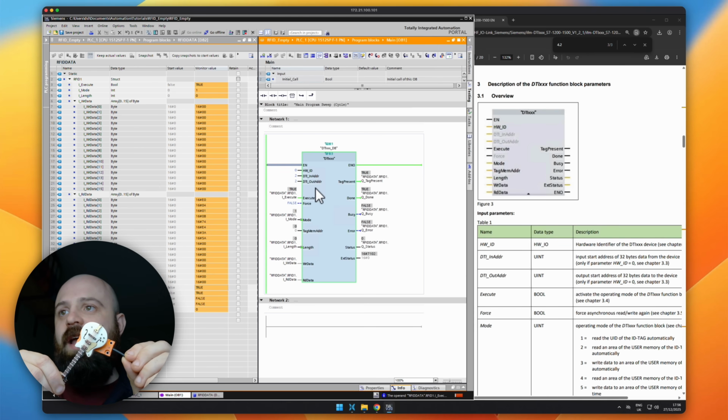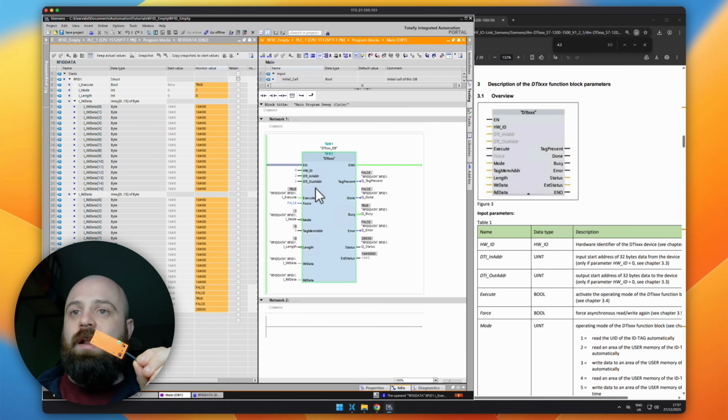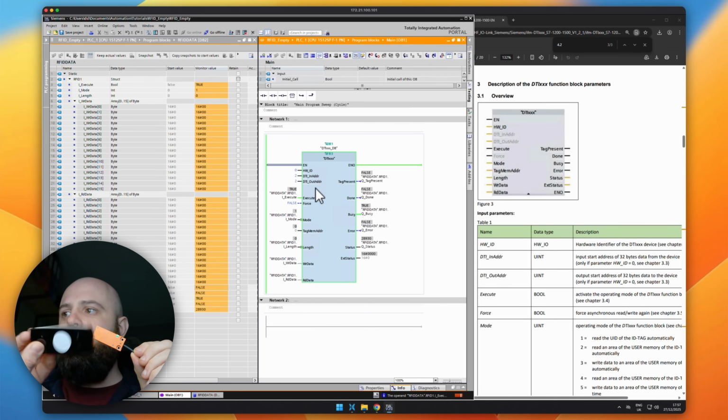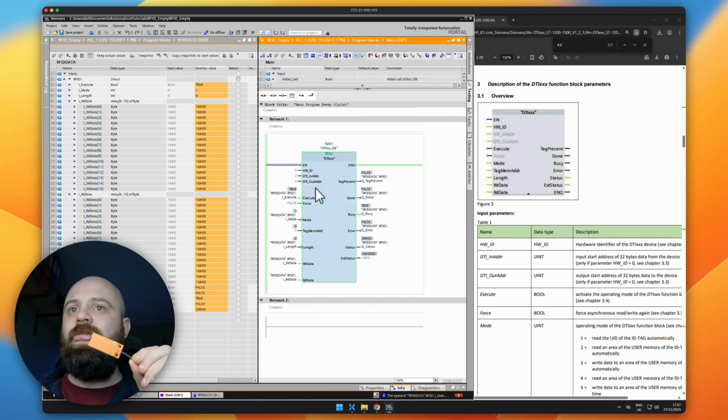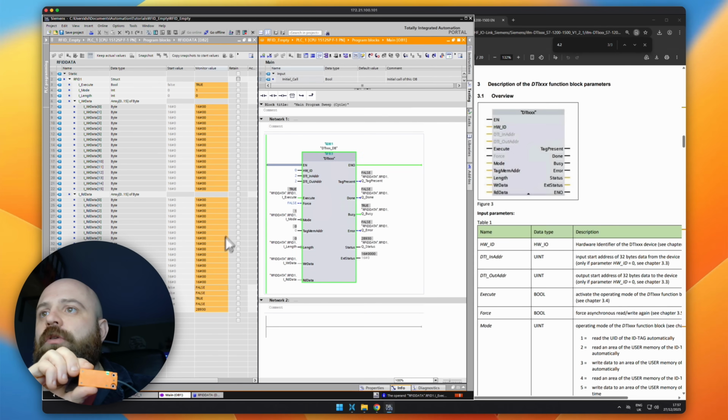So you see 3A, 5A on byte number 6 and byte number 7 there, and that shows that we have the guitar here. And if I pick up this small piano that also has an RFID tag on the back and put it in there, then we see, there we go, the two different RFID chips working. Perfect. Okay, so this is good. We're able to read the UID.